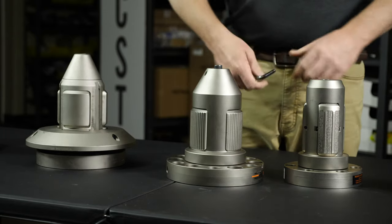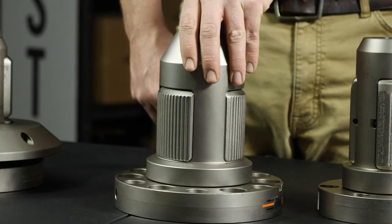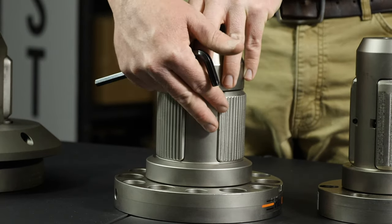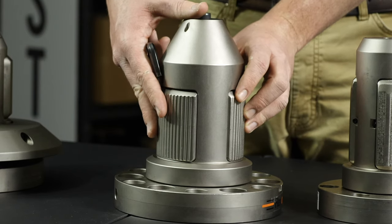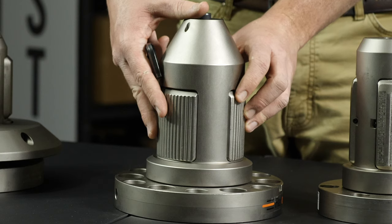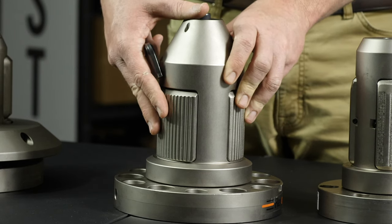Let's have a closer look at some of the chuck's remarkable features. Our standard jaw design features serrated expansion units. By implementing the serrated jaw and creating an extra large contact area with the expansion units, we can easily grip worn and recycled cores. This means we can reduce slippage and dust and core debris created by core slippage.